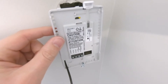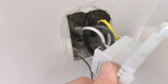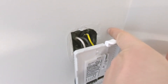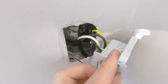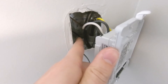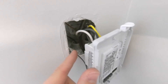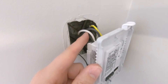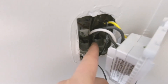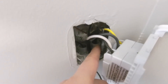Now I've got the box turned around and my cable coming in here for the sensor in the floor. This is a mud box — an oversized box. I'm going to tuck all the power wires over to the right side of the box and keep the sensor wire on the left side, trying to maintain distance between the two to prevent interference, since this sensor wire is measuring resistance and could be thrown off running too close to the power wires. They actually require that two separate conduits be run down to the floor to separate the sensor wire and the power wires.